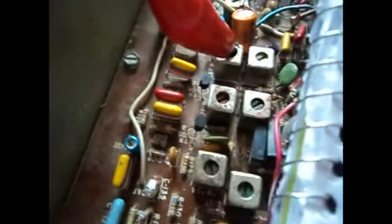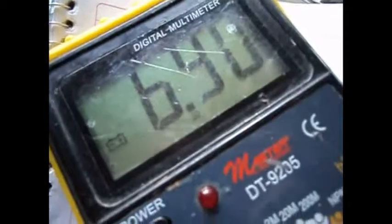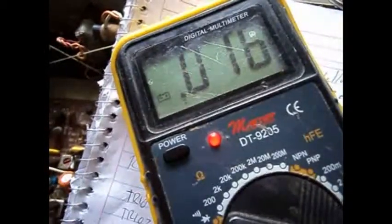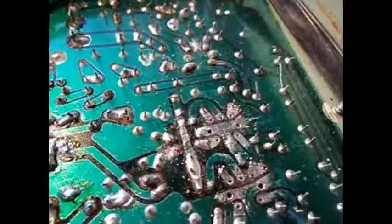So let me pull the transistor and see what the deal is. So here are those voltages. That's base, 650, and collector, 653. Let me do a continuity check. So there's continuity between base and collector. And so it definitely looks like maybe a short or something. Although the weird thing is, if that thing's shorted, why is the FM still working fine?